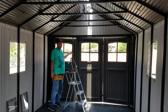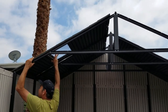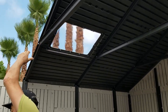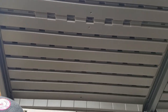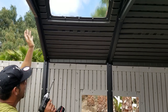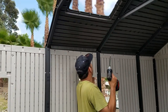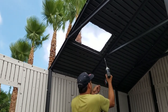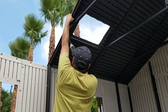Here are your other roof tiles all the way down the rest of the way — installed just as you see here, same fashion as the corners. They go on the same way. You line up all these holes with the holes at the top of your wall line. If you look through each one of these holes you might have to clear some excess plastic buildup inside the holes, just to see through them and make sure it's lined up. You have to pull a little bit of extra plastic out of there — it's called deburring. We have a video on that as well. You'll be able to see through without any plastic buildup in the way.